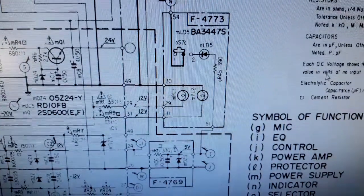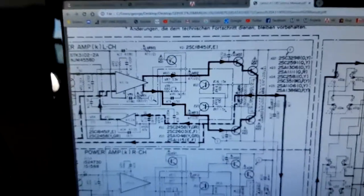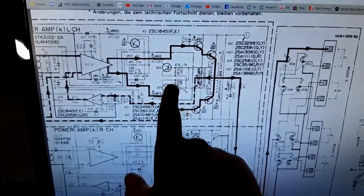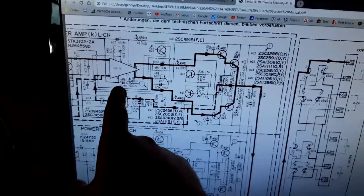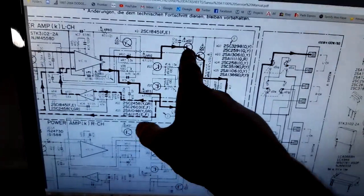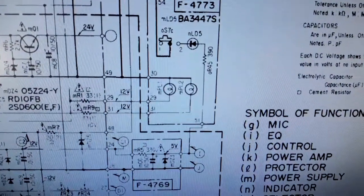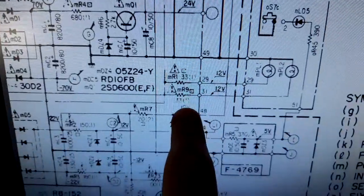Here in the schematic I found it — wires 29 and 31, though they're reversed in the schematic. Apparently I should have 12 volts here. I need to find resistors MR1 and MR9. I believe I found them right here by this connector. This one is stamped 33 ohms. I bet you these are those metal oxide fusible resistors — I've seen these fail before firsthand. A Fisher RS-881A had the exact same issue where one of those metal oxide fusible resistors that feeds the supply voltage to the digital input switching chip went high to about 1.3 megaohms and I had no sound — took two months to find it. I know a little better today.